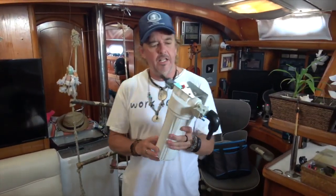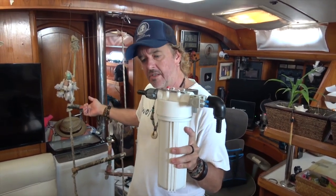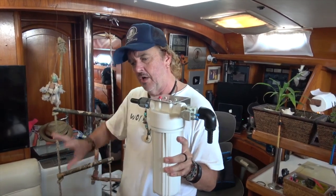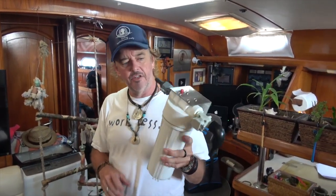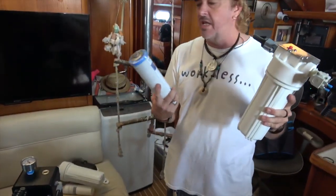There's a secondary filter used for the back-feed flush — it strips chlorine out of the water. There's a line that automatically takes purified water from your storage tanks to flush the system whenever it finishes making water, because you need to flush all the seawater out before shutting it down. That water runs through a carbon filter first, because if you've ever used chlorine in your water tanks or taken on city water supply, you never want chlorine to hit the membrane — chlorine will instantly destroy the membrane. This is a simple 10 micron block carbon filter that effectively removes any chlorine and chemicals that could damage your membrane.